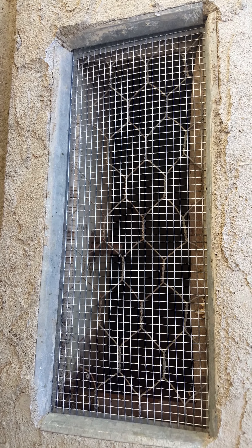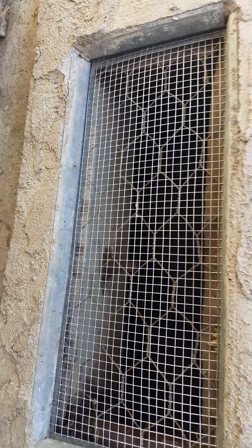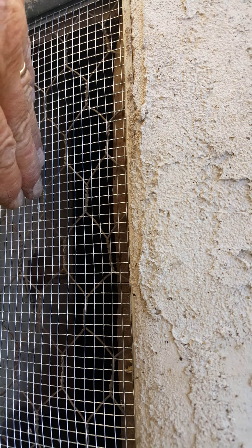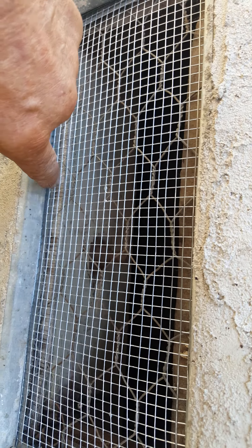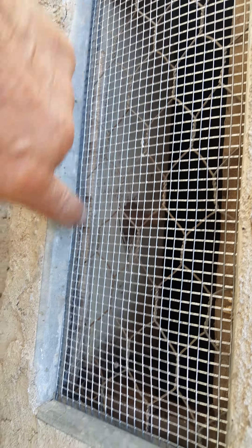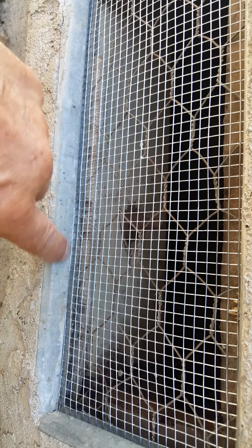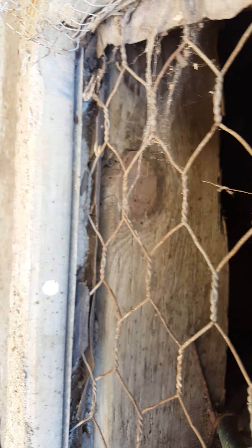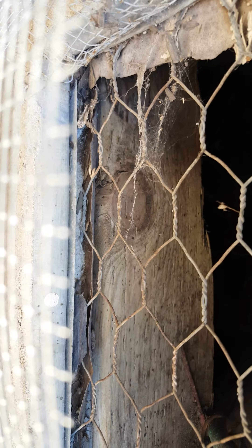Let me point one thing out that a contractor pointed out on YouTube, and he's very right. If you look through the screen, right there is exposed wood past the chicken wire. If rain comes down in this direction — if this were a house that had a lot of rain and wind on this side — that rain would come down here, hit the exposed wood along the foundation, and all these foundation vents are gonna rot. I suggest putting louvers over the top. They looked at me like I was crazy. As you can see, right there is the wood — the rain is gonna come through. If you have the same circumstances, put a set of louvers over the screen.